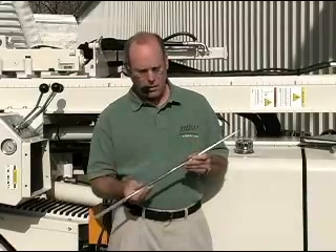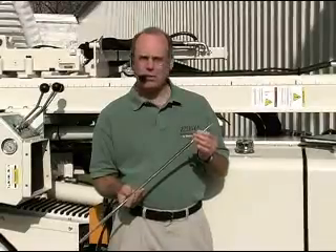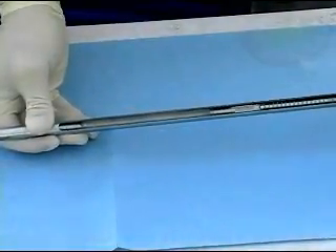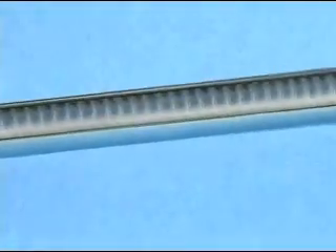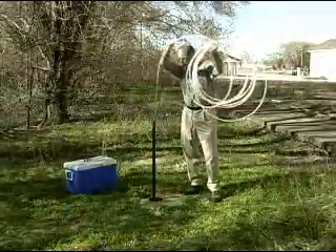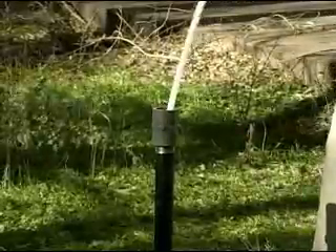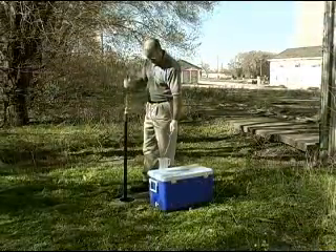It's a very simple mechanical pump, and you'll see that all that's necessary to operate it is to raise and lower the internal tube and the inner tube adapter to actuate the bladder and pump water to the surface. It is mechanically operated, so you don't have to have compressed air or compressed gas such as a nitrogen bottle to operate this pump in the field.